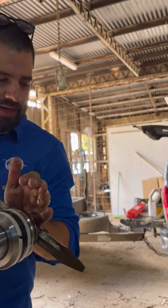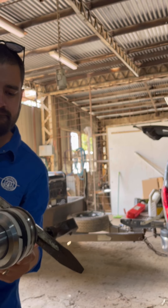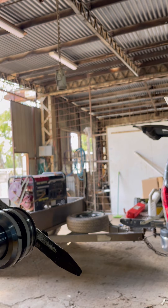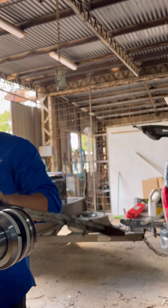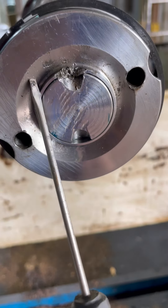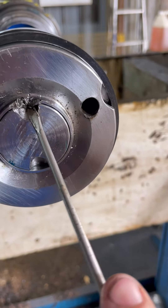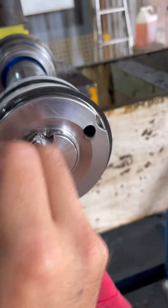I'm going to put that hammer down here, put that on - give it a hoist. That's about where it needs to be. That's lined up pretty well - punch that back in. Good practice to just go around with a screwdriver to make sure you've got no nasties on there, because you don't want that ending up in the hydraulic system. No loose bits of metal. Give it a bit of a wipe. She's right to be put back together now.